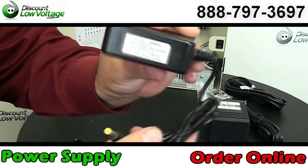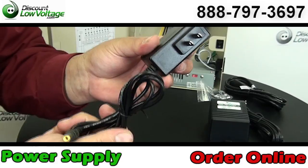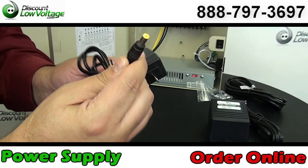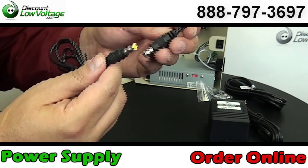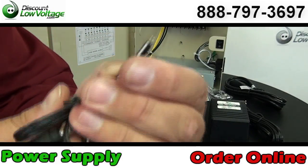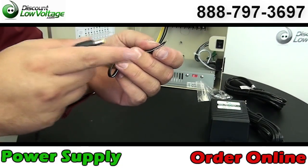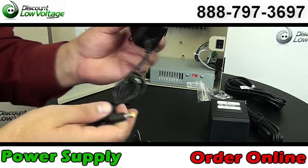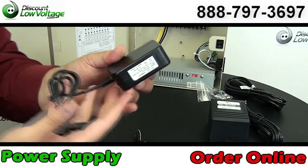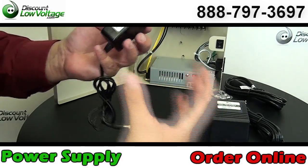Now, if you're using individual cameras, the 12 volt, remember, match up the power to your camera. This is probably the way you want to go. These are definitely most commonly sold in residential type applications. The cable on the other end is just for your power, but you may need to purchase a separate pigtail to line it up with the power. On the other end of the pigtail, you have your two conductors where you can make your splice to your coax cable and your 18-2, which we'll get to in just a moment. So this is definitely more common with residential installs. It's the slim style, so if you want to install more cameras, you can put more of these on a power strip instead of taking up a lot of room.